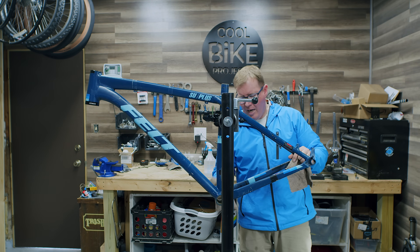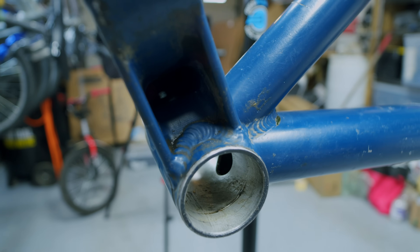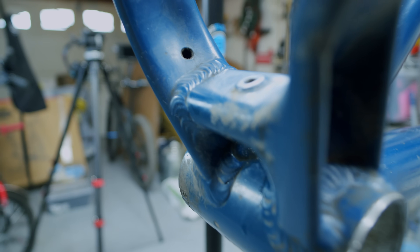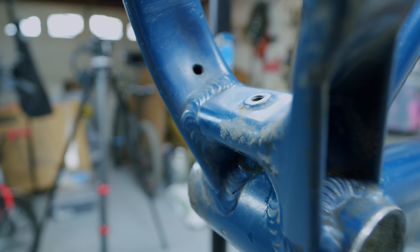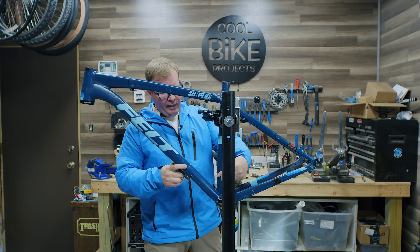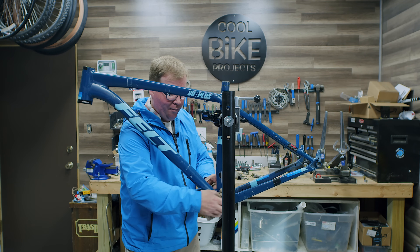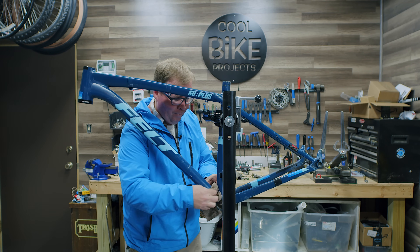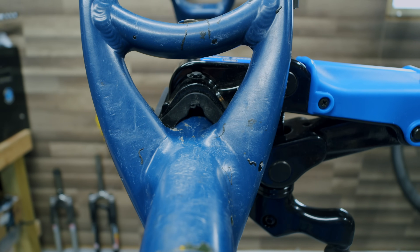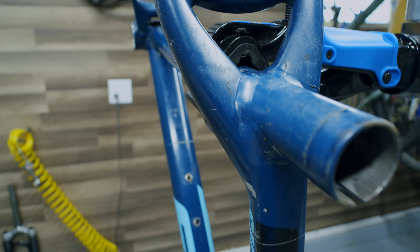What's interesting about this frame is there are little weep holes all over the place, especially down near the bottom bracket spikes, which allow moisture to get out of the frame in case it gets wet. My first suspicion is that this guy's been jumping quite a bit — it would take one heck of an impact or some type of side impact to get a stress fracture right there. Right now I'm not seeing any cracking around welds or areas around the bottom bracket where you'd be suspicious.